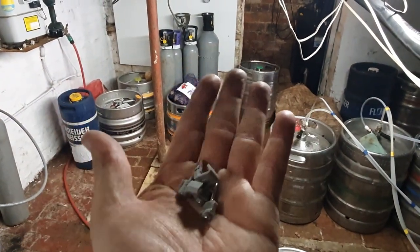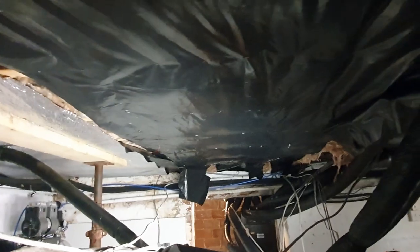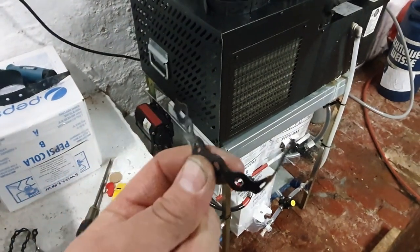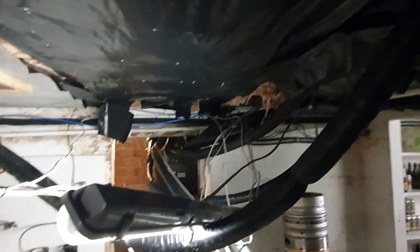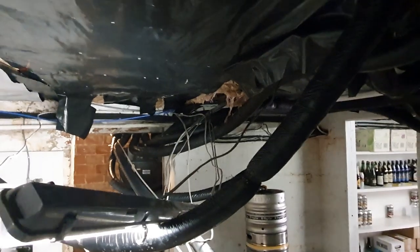At the moment, I'm just taking out all of these old cable clips because we're going to be remounting everything with 18th edition metal clips anyway. So they're going to comply with new regs, even though it's an existing installation and we don't have to do that. I thought while they're coming down, it makes sense to do that while they're going back up. But as you can see, it looks very strange seeing everything hanging from the ceiling. So I'm just going to measure up, cut another sheet, and hopefully this will just slot in and staple up, no problem.